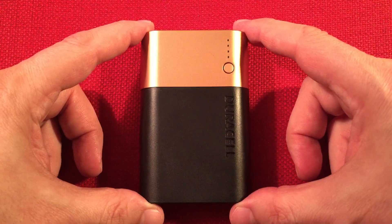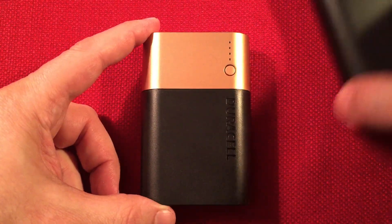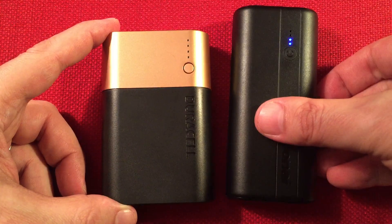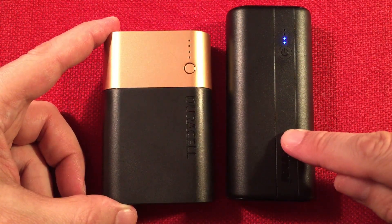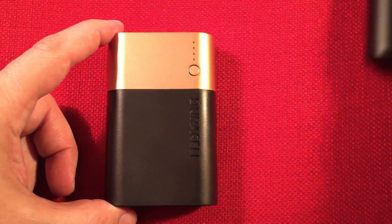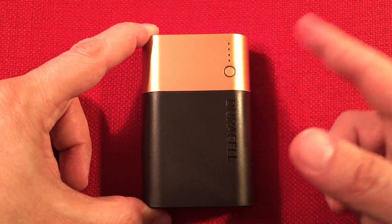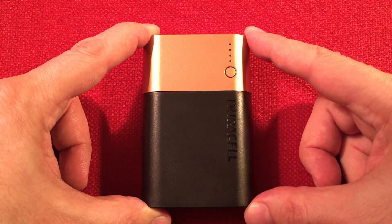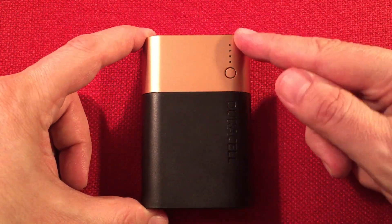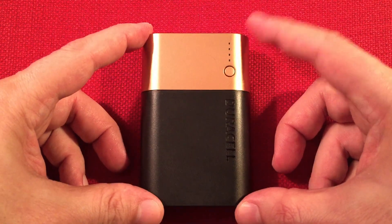So the PB3 — is it worth the money? When this thing is on sale? Yes. It goes on lightning deal every so often. I'll have Amazon links below. The Bonai is pretty cool because it has a flashlight built in. The Bonai generated 5,872 milliamp hours to the iPad — total 29 watt hours — so almost identical to the Duracell. When charging the Duracell itself, it took a 2 amp charge. It might take more since it's rated up to 2.4 amps. It took 8,431 milliamp hours or 42.89 watt hours to charge from empty to full, and time-wise about 4 hours. So it does take a little while to charge this power bank.